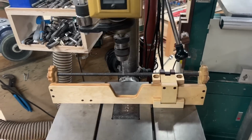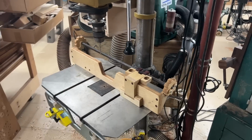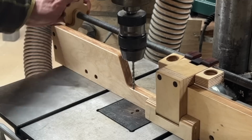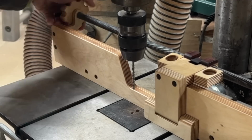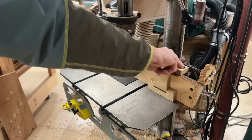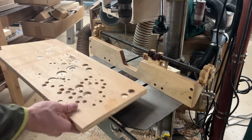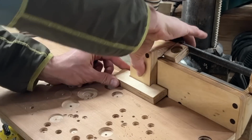If you were at Workbench Con this year, you did not see this fantastic DIY drill press fence that I made, with a flip stop that micro adjusts but still positions anywhere quickly, a low center for tight drilling close to the fence, and an adjustment on the flip for plywood underneath the workpiece.